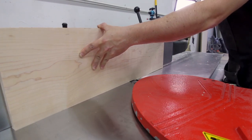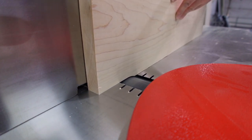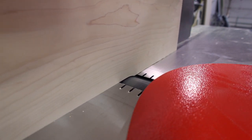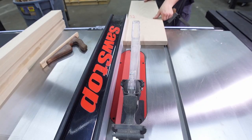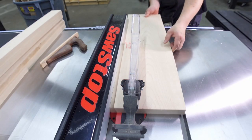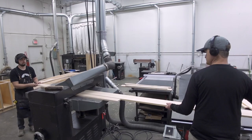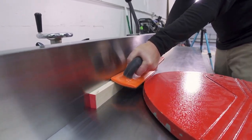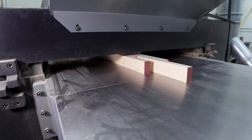When I'm using the jointer or any machine for that matter, I'm always paying close attention to where I'm applying pressure. It's amazing how much feedback our fingertips can give us when we tune in. Sometimes you can even feel if you're getting tear out because the heavy vibrations will resonate through the board. I'm sure at first it's hard to notice this stuff, but utilize your hearing and touch senses to give you input on your cuts. When you begin to understand the certain sounds machines make when they are cutting well versus when they are cutting too aggressively, you can also feel these sounds in your hands on specific machines, even through push pads. And remember that sandpaper prank?